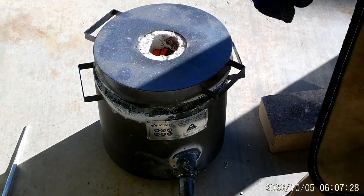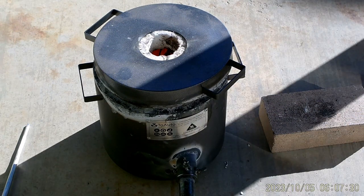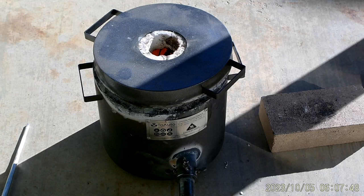Okay, we'll let that sit for just a little bit. That one piece is a little bit high so my lid isn't tight, but it's getting a lot more air so it ought to heat up really quick. I've got about one pound two ounces in. That lid will start settling, and when it does I'll put some borax in and stir to try to get the dross out.